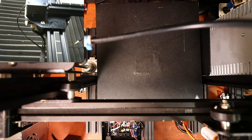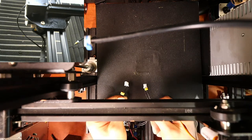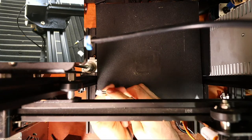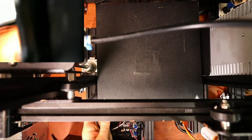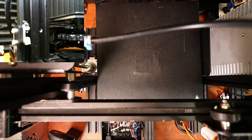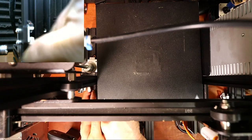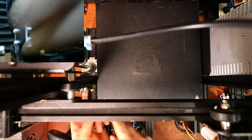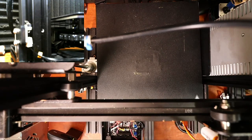So let me see if I can see what's going on. So here's another cable for the end stop. Hopefully it's set up the same way. Otherwise I'm gonna have to take it apart to look, but it's for the Z axis. So you can figure out what the actual polarity is by looking here and here. And then you can see that it says voltage and signal. I avoid doing that only because it's dangerous initially. It's probably correct, but who knows? I don't like doing voltage and signal together. So I'm assuming it means ground, and they just wired it funny. But worst comes to worst, we can try it. But obviously there's a ground in between, so I'm assuming that it's gonna go into voltage and ground. So we're all set there.